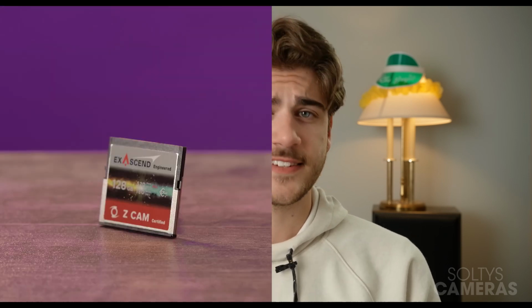There are essentially two methods to updating the firmware on your camera. The first method that I'm going to show you involves using some kind of media card and loading the firmware on there, and the second method is using an Ethernet cable. The first method is the most simple one in my opinion, and it applies for both CFast cards and SSDs.